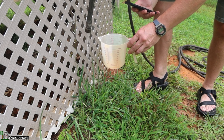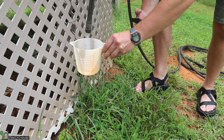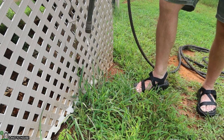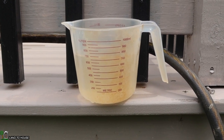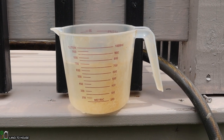This is the output with the water hammer arrestor. Let's go ahead and time the same one minute and see what we have. The results are in: it looks like we're at 750 milliliters, which is approximately 25 milliliters less than the previous test. So it's so close I would say it's about the same, but this seems to have just a little bit less output than the pressure tank.